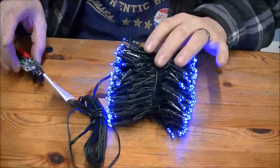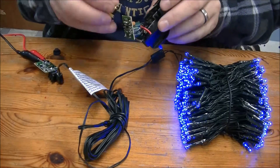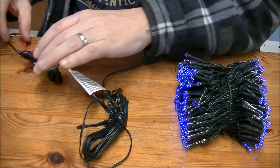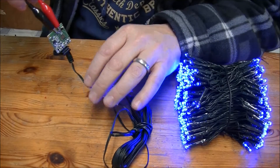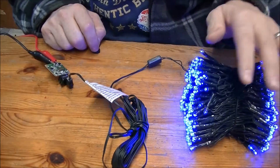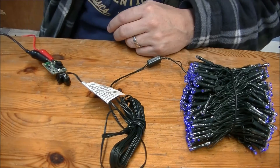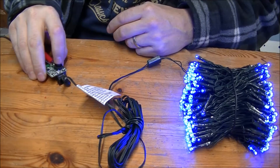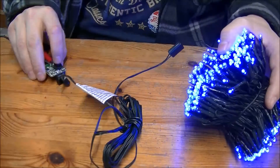Managed to get them working off the controller. I've cut this section out — basically cut the transformer out and anything to do with the switch-mode power supply — so that's all gone. I've literally just put 31.16 volts on the input and then they work. So it is possible to get them all lit at the same time, which is definitely on the cards for this project — trying to do that with DMX. They show quite bright with them all on, so I'm quite happy about that.